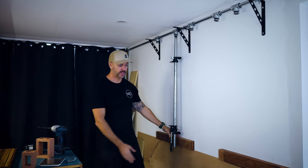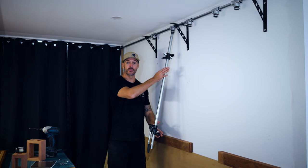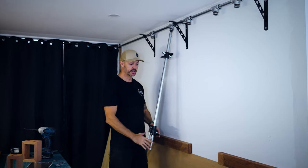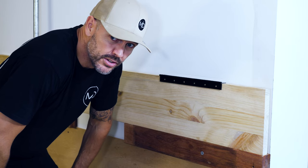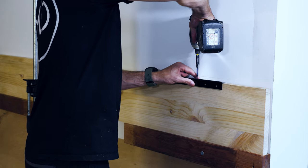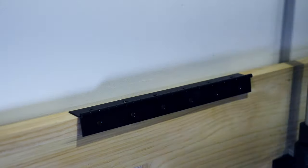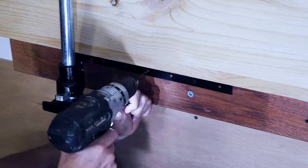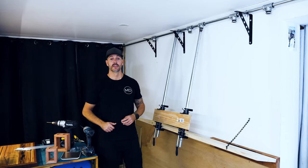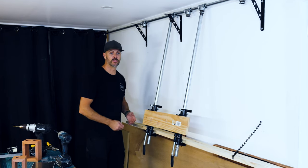What I've done is put a rail down the bottom and I'm going to put a hinge shelf on so it brings the clamp out a little bit, giving you a bit of angle — so as you're putting your boards in they're not just going to fall forward. Then to save space after they've been loaded, I should be able to lift that shelf up and push the clamps back down to the wall. First up I'm just going to fix this hinge to the shelf. To finish off this last section I'm putting in a little bit of chain to support the shelf whilst it's in action — an added feature to stop it dropping to the floor when the clamp's in action.